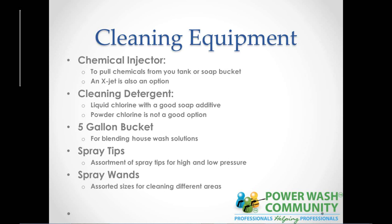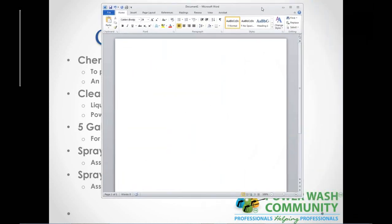Right. And usually those black soap tips are about a 20 to 25 size nozzle. Right. And real quick, I'm gonna put a Word document over here so I can type some things so people can see. The first two numbers on a nozzle, that's the degree. And then your second two numbers would be the size. Like you just said, you got a 0040. That would be your size. And if there happens to be a third number there, that would be like a half size. In our industry, you won't see a half size that large.